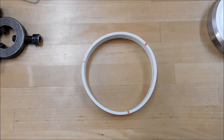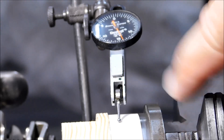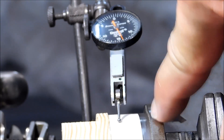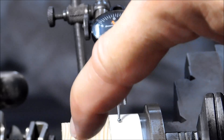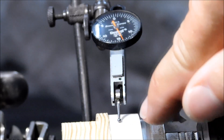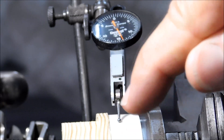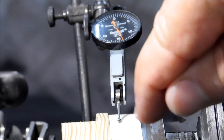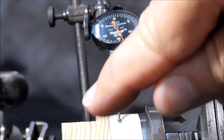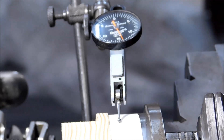This current setup is strictly a sandwich operation. There is no locating diameter on the major driving plate back here on the sacrificial pressure receiver, because the wooden part right here is doing all the pushing. There's no turn diameter on that, so the risk of no location diameter is that the part can slip out of concentricity. With a plastic part like this, if you apply too much end pressure, you could force a bulge in the center, which translates to a low spot after the turning operation. So get a feel for how much pressure you can put on the part that you're working on.